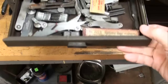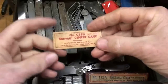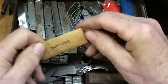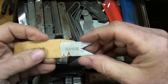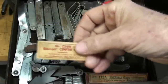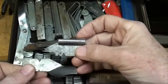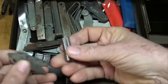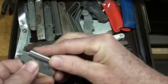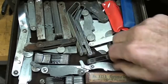I think you'll find this to be an interesting drawer — all kinds of gauges. Let's start with a Starrett center gauge. I have to keep this in the original case — if you notice anything different, it's a Whitworth gauge. I have never used it and probably never will; it belongs over in England I guess. There are several regular center gauges here too. If you don't have this attachment for your center gauge, be sure and buy it — when you're threading on the lathe, this is a particularly nice little attachment. Watch my threading videos to see why and where I use that.